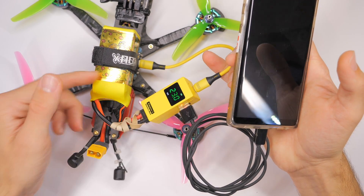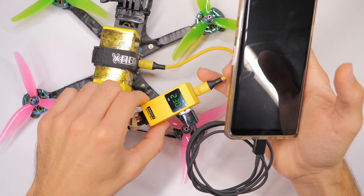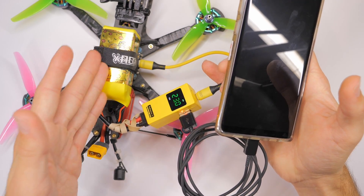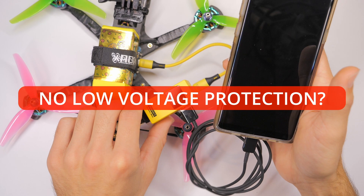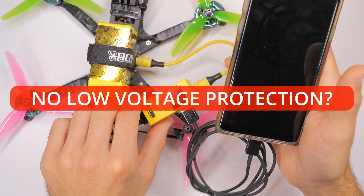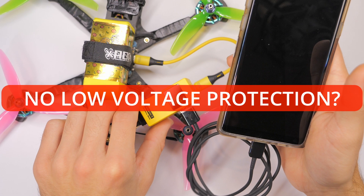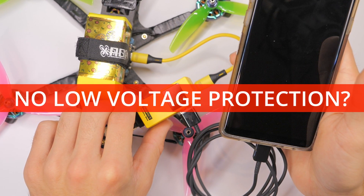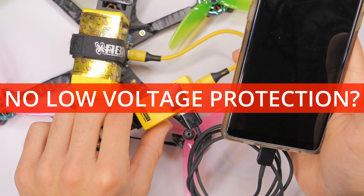In terms of charging your phone, this is still going to deplete your LiPo batteries. Maybe your phone's going to die and you don't want it to, so you take some juice from your LiPo battery pack and put it in your phone — in which case this is super convenient. One very important point: I don't think there is a low voltage shutoff for your LiPo battery. If you leave this connected to your phone, it could potentially drain your LiPo battery too far. I have not seen anywhere in the manual where it says it will shut off power if the voltage gets too low, so always be around when charging to make sure the voltage doesn't get too low on your LiPo battery.